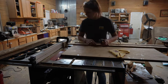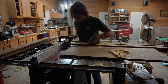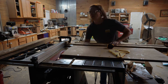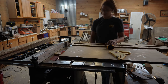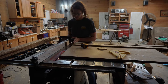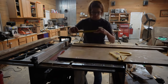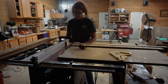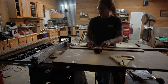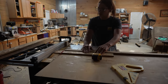Now that I've rough cut the width, I'm going to make the side pieces. I make these perfectly square so I don't accidentally mix up a longer side. Whatever width you decide for your window valances is how big you'll want to make these squares — so if it's three inches wide, you make a three-by-three square and make a bunch of those. I usually make extras in case I mess up so I don't have to cut more.